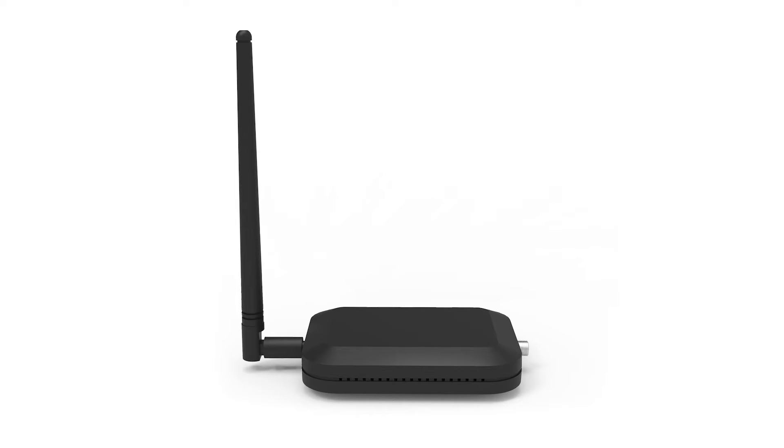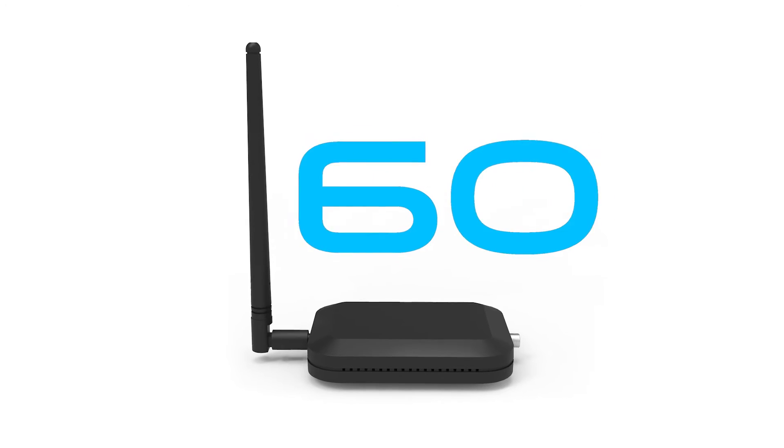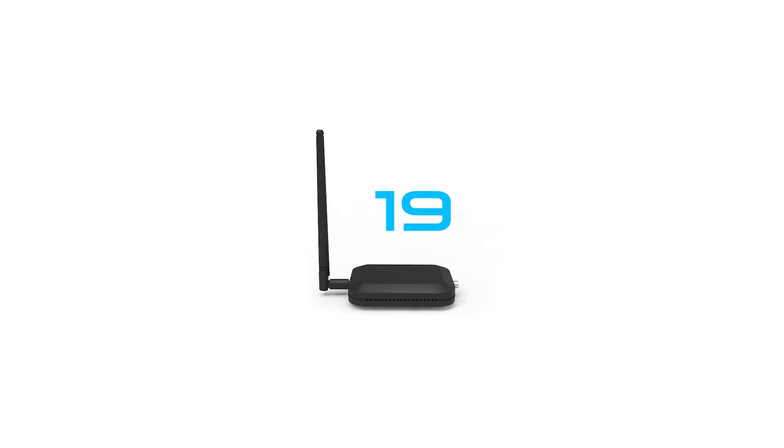Before I start, there is something I need to explain. This is listed as a 65 dB booster, and it is a 65 dB booster — but does that mean you're going to get 65 dB the entire time you use it? Not necessarily. You're going to get less boost the further away you get from it, and that's why I took measurements at three, six, and nine feet to show what the real-world boost is.